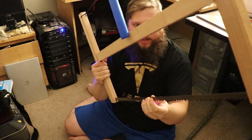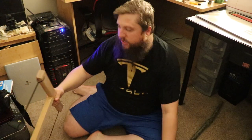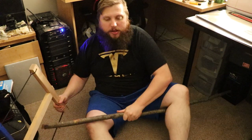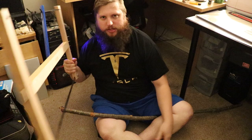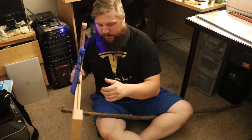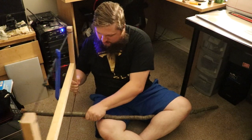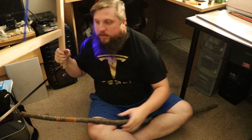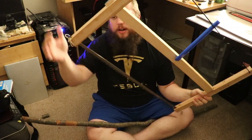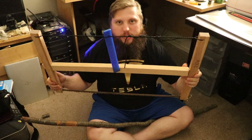I've wound this thing as tight as I'm willing to push it so that I don't crack the wood. This thing is tight — it is not moving in the wood. So now I'm trying to saw another piece of this, and it should go much smoother now that I've got it much tighter. Because the tighter you have the blade, the less give it's going to have when you're sawing — to my understanding. This is literally my first saw that I've made. It's kind of big so it's a little unwieldy because you have to grab it right by the base. There you go — it does a pretty good job. I think it'd be much better on a piece of wood that's fixed and not held loosely between my legs. That blade is nice and taut.